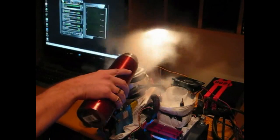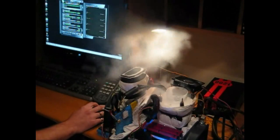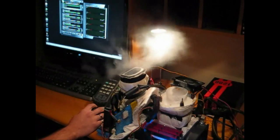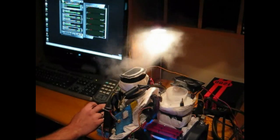For the graphics card we'll use MSI Afterburner overclocking tool. We'll open that up, set a nice easy 1.6 volts, 1380 on the core, and 1360 on the memory. I'm sure that sounds safe. Click apply, close that.